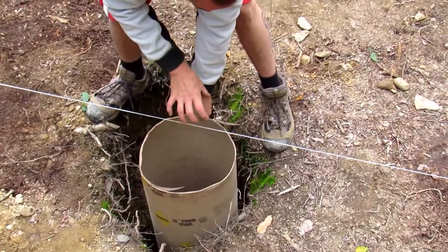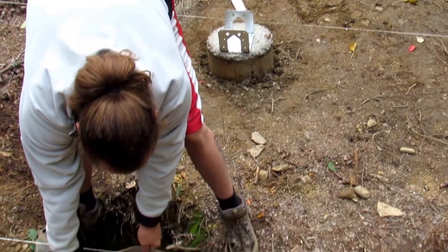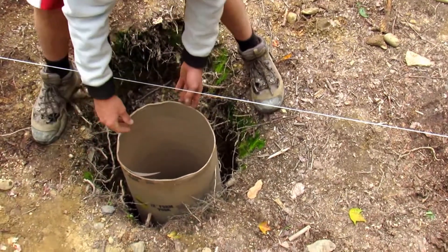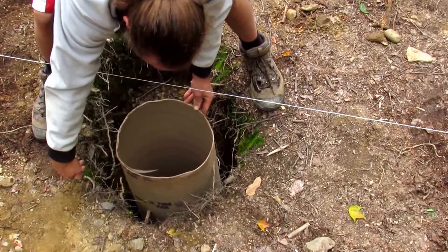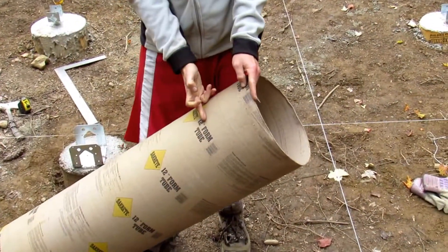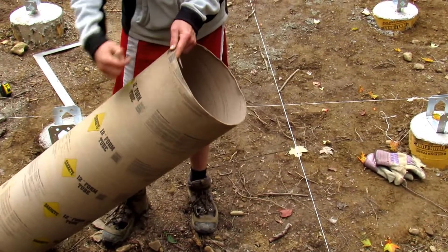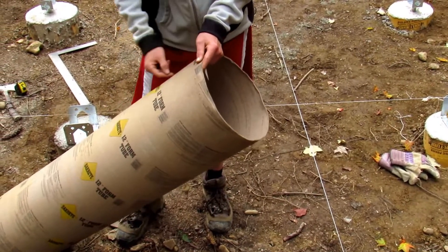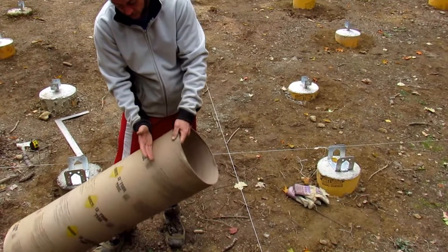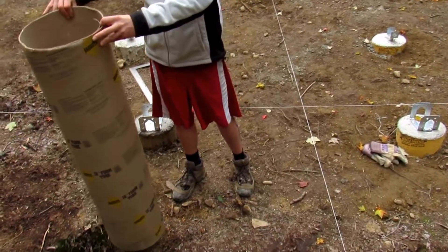You have a little play with your bracket - instead of having it right in the middle you can have it towards the edge. If you run into a rock and need to cut the sonotube, lay a flat line across it, mark it, bring it up out of the hole, measure where the mark is, make four equal measurements around the sonotube, run a string around it, mark with a marker, then cut with a hacksaw. Slip the tube back into the hole and fill from there.